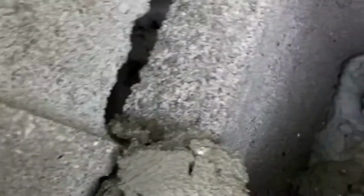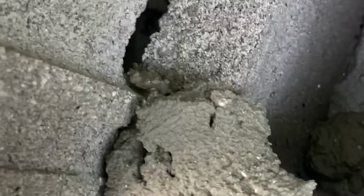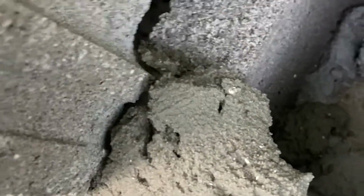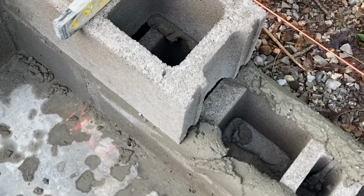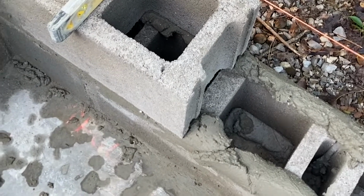Okay, when you're setting that block, you've got to sit on that end, but a good way to measure yourself out is this seam needs to be in the middle of that web. That keeps your strength, that keeps you modular, that keeps you square. So you're square to the string, you're level, and you're hitting it right in the middle here. And if you do that on every row, you're going to be able to fly through this with very little checking and measuring because it's all set up modular. So you'll get your skills, but we'll keep going and giving you tips and pointers.